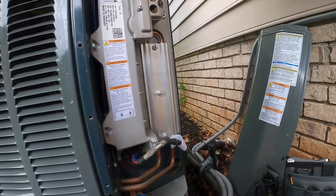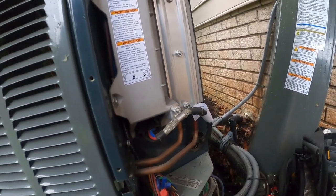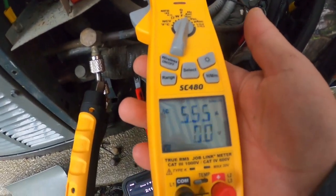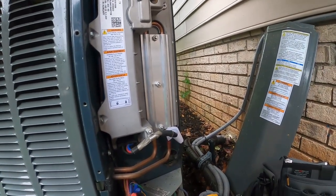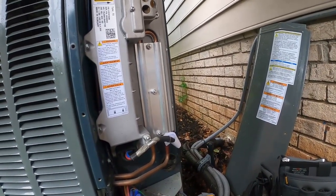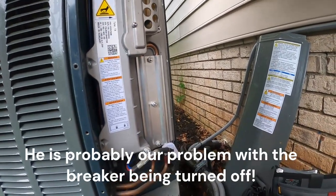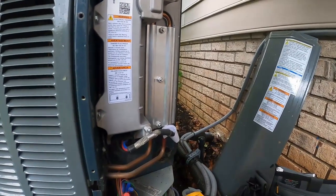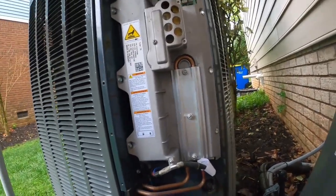Let's see what this pressure looks like — it's 74 degrees in the house. The amp draw on the compressor is good; that's a 25-amp breaker in that box and we're at five and a half amps. They did say sometime in the last couple of months they had their crawl space sealed. She said she told them not to do anything with the AC equipment — they may have just turned the breaker off thinking it was the breaker to the whole system to be safe.